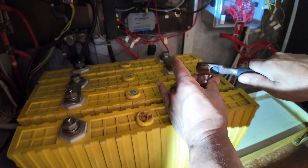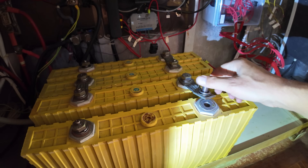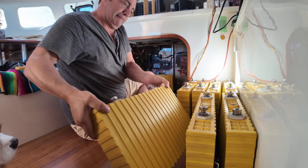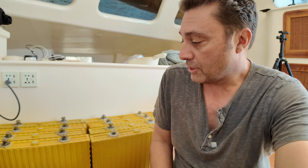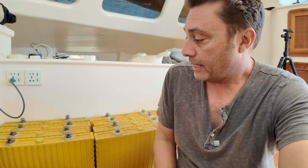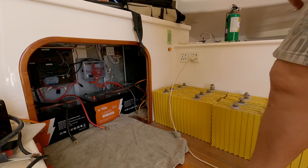The mission is to get the connectors across the terminals. From experience, they get fat like this because the chemistry changes with voltage. Once the voltage gets back to around 3 volts, they lose weight — it's amazing. So what we're going to do is charge one pack at a time, bring it back to about 3 volts, get them to lose weight, and then when the Amazon charger arrives, do the top balancing properly.